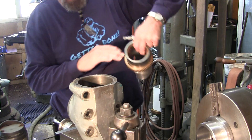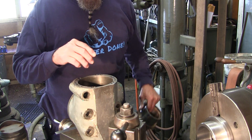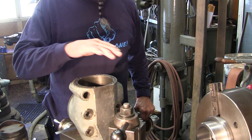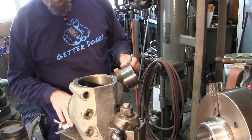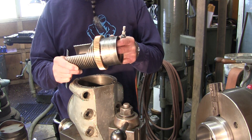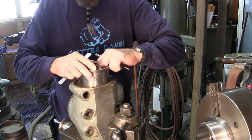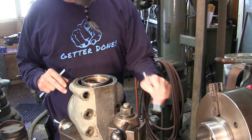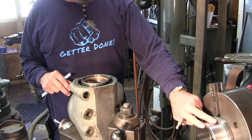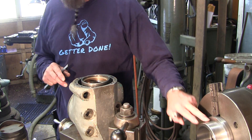When I pull this out and look in here, I actually see a void from where this gear sits and the bottom of where that ring goes. There's a missing component, or the way this is held in for thrust that I can't put two and two together with the parts I have. We're going to let that fly — we're within two thousandths of the original, two thousandths strong.